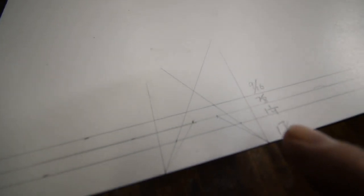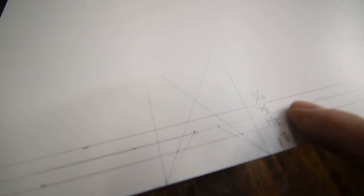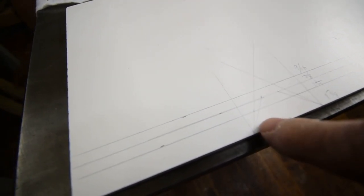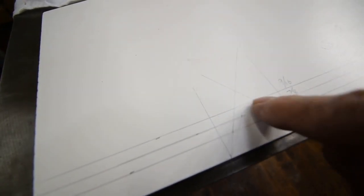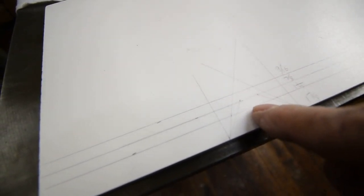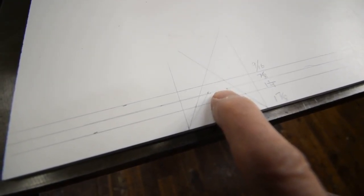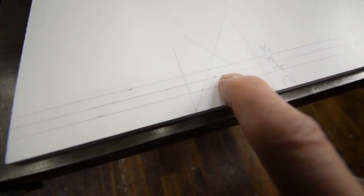All right. What we have here, I have three lines drawn on this board. One at 1/2 inch, one at 3/4, one at 1. Now, this is 1 7/8 wide, the same width as my tenons. And at 1/2 inch, I want it 1¼ inches. So that's this outside angle you're looking at. But at 3/4 inch, it's 7/8 wide. I only wanted a 1/2 inch showing on my tenon instead of 7/8.